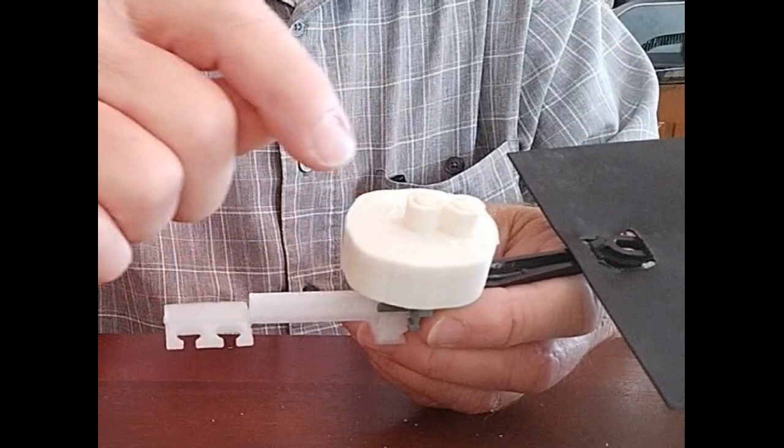This one here, it needs a little work. Every year you'd want to clean it out. At least it's accessible where you can take it apart and clean it and put some heat-proof grease or silicone grease in the valve to have another season of function. And I think it could extend your compressor's life significantly just simply by keeping the head pressure down and the power consumption down.